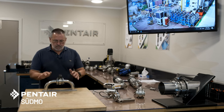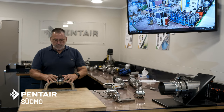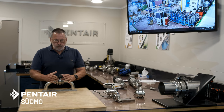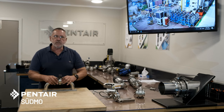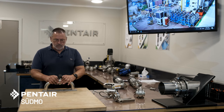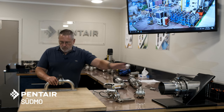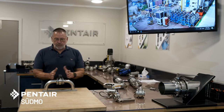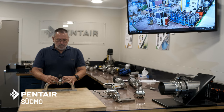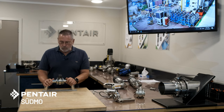The wafer style comes in everything from one inch to — this is a five inch. The big advantage of wafer is that when removing a valve from service, you have to pull the two flanges apart the width of the disc and seat assembly, which on a small one is about 17 millimeters, larger ones 20 to 22 millimeters. That's a long way for stainless steel to stretch. The wafer only requires parting those flanges one millimeter — most pipework assemblies can handle that without any other adjustment or modification.